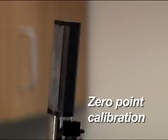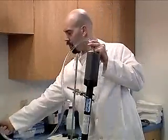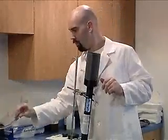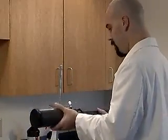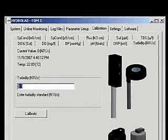0-point calibration. With the sensors pointed upwards, fill the storage cup approximately 75% with deionized water or less than 0.1 NTU stable cal and screw the storage cap on tightly. Slowly turn the sonde over so the sensors point downwards.